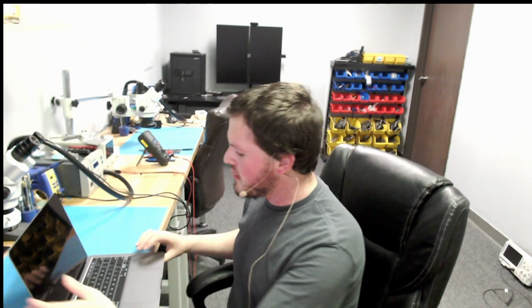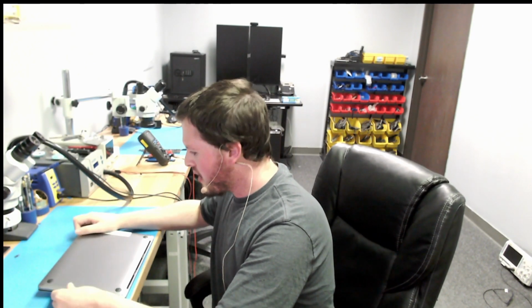That's going to be really hard to pick up on stream. So let's go ahead and open this up and see what's going on. There's going to be something up in the backlight circuit, and we'll go from what we find here, but it's probably going to be corroded capacitors, corroded traces, maybe corroded backlight drivers. Something is going to be messed up. So let's go ahead and jump right in, get the bottom off, and get this board out.